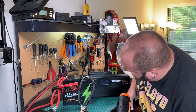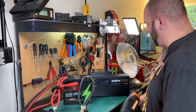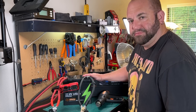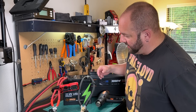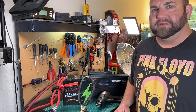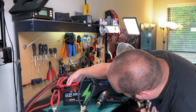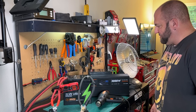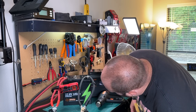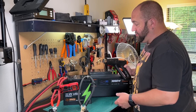We're at about 122–123 amps, 12.2 volts at the inverter, 1,340 watts, holding steady at about 123.9 amps. We're not seeing any shutdown of the BMS, which is pretty close to the rated 120 amps. So I'm going to turn the space heater on as well — that's pulling about 93–94 amps, 1,040 watts. Once it fully heats up, we're sitting at about 90 amps. Adding the heat gun on low gives us about 150 amps, which should trip the BMS.